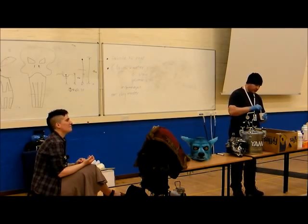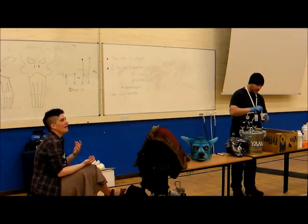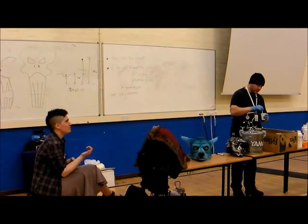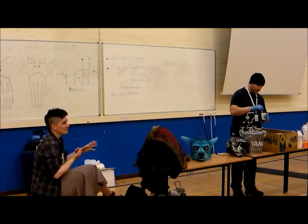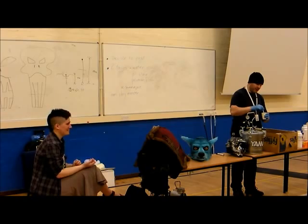The resin that Zay is using is a polyurethane resin, like we were saying. It has this diisocyanate, which is a skin and respiratory sensitizer. If you splash it on your skin accidentally on a YouTube video that you're making, while drunk, you're an idiot.